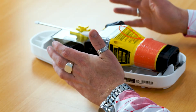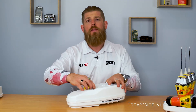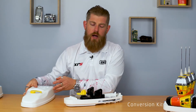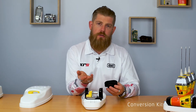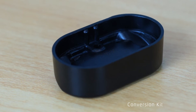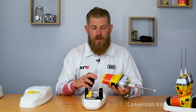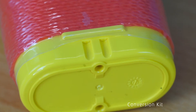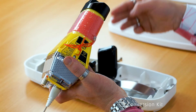We also offer a conversion kit, which enables you to take your MT603G and convert it into a float-free configuration. The float-free conversion kit looks very similar to a float-free EPIRB, however there is no EPIRB inside the housing when supplied. What is supplied is the housing itself, the hydrostatic release unit, a black boot, and two mounting screws. The black boot is designed to mount on the bottom of the MT603G beacon to enable it to sit securely in the float-free housing, using the two slots on the beacon and the two screws supplied.